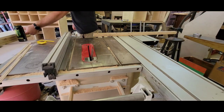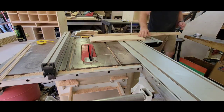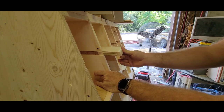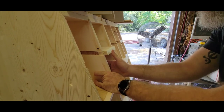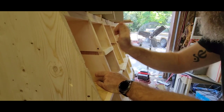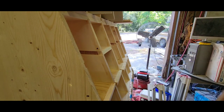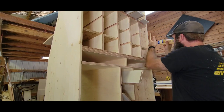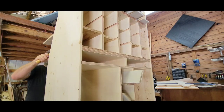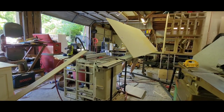My table saw blade is tilted — these are the sub-dividers, exactly the same as plywood with edge banding — but I had to cut 20-degree angles on the fronts of all those too. These are the little shelves that go in, and you can see that by cutting the 20-degree angle, it matches the angle on the rest of the cabinet. I'm knocking that in as a test fit. I had to make all of them the same way — 10 of them per cabinet with the angles. I'm just gluing them in: very snug fit, put glue on the back side and hammer them in flush.